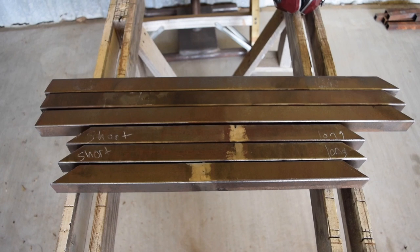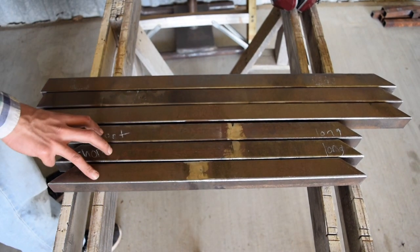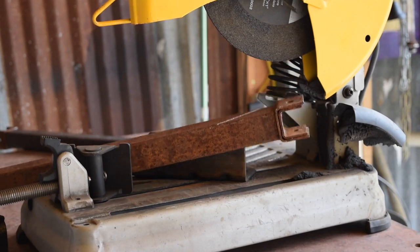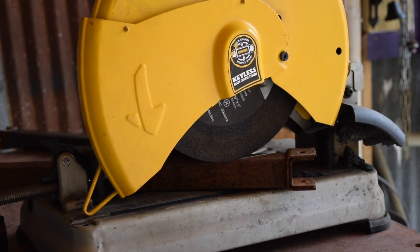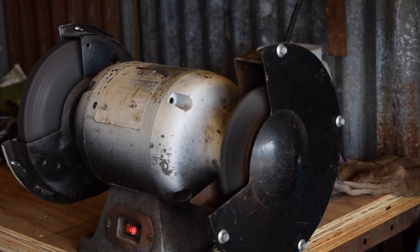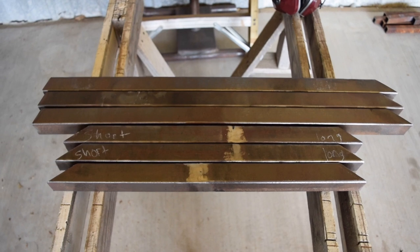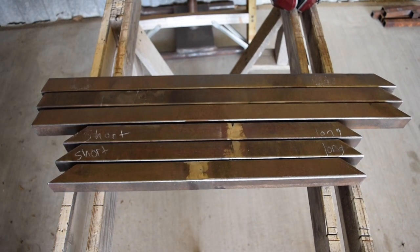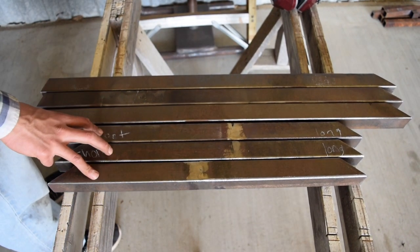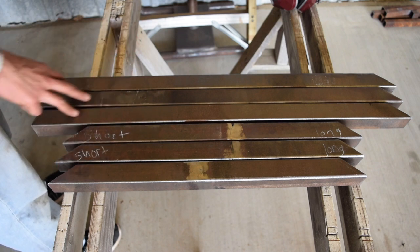To start, I had to cut out three pieces. These three pieces were 24 inches long and they both had an angle on each end — the short angle was 33 degrees, the long angle was 37 degrees. Here I am cutting the three.